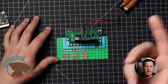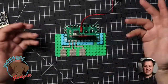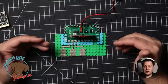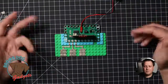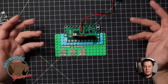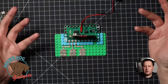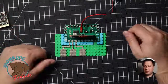We've gone out from one of our Crazy Circuits invention boards, which is just a Teensy LC on a Lego breakout board that has 11 capacitive touch points, so we could activate an MP3 player module to play MP3s. So that's what you're seeing happen. It's touching a vinyl cutout, and we've got conductive tape behind there. It's acting as a button press to then play an MP3 file, which would be perfect for Halloween. You touch a doorknob and, oh, scary sound effect happens because the doorknob is metal. So Pete, roll that clip.